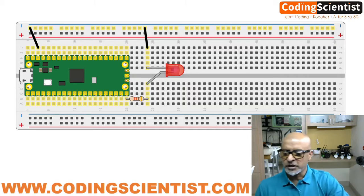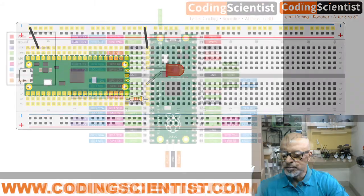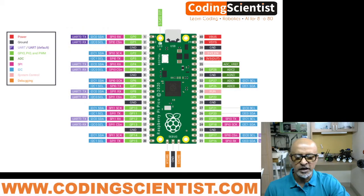And the most important aspect is the pin diagram, right? This diagram I shared with you in one of the earlier lessons. You need to refer to this, guys, very important. For example, if you go by pin number 1 here, which is written as 1 2 3 4, that is actually not pin number 1 2 3 4. You should not get confused, right? That is just the nomenclature, because there are 40 pins. The first row is 20 pins and the second row is another 20 pins, right? But basically the pin number 1, what is written here, is actually GP0.